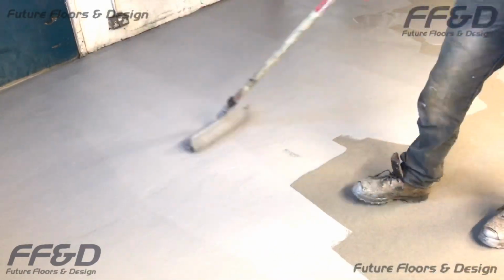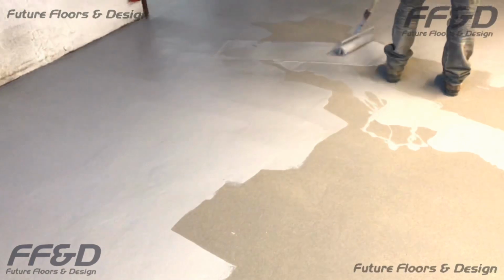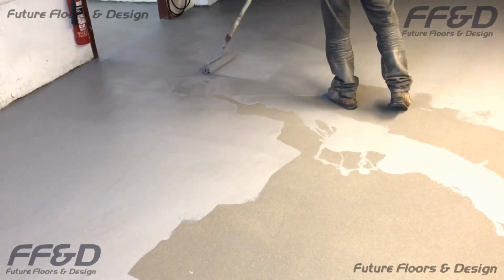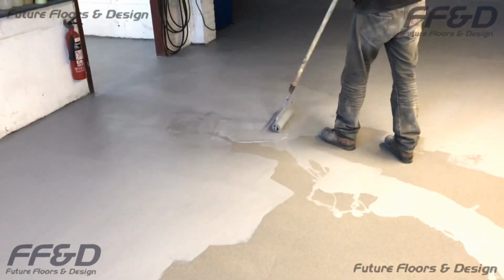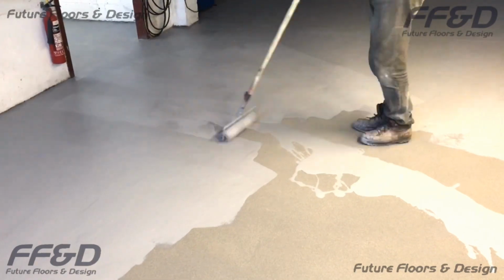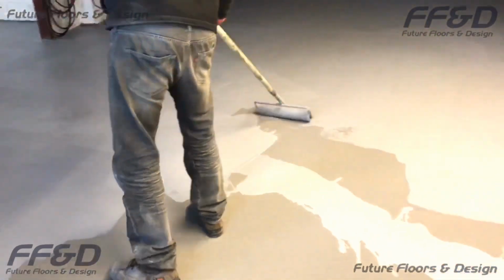The key to coating anti-slip uniformly is to keep your roller head loaded with Highbuild by pouring a line of coating along your painting route. This is because the anti-slip surface will quickly use up the coating on your roller head due to its rough surface and porosity. If your roller head is too dry, it will begin to suck up Highbuild off of areas you have already coated, making the coating appear patchy instead of uniform.